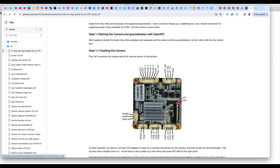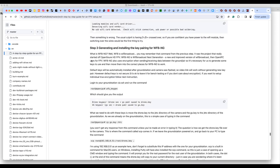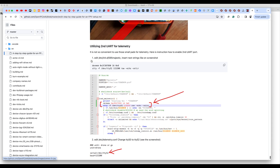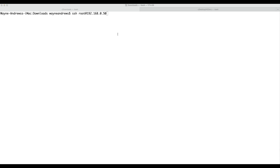If you went ahead and soldered your serial connections on the TX and RX here, you don't need to do this bit. As I mentioned in the last video, I found that a bit dodgy and wanted to use this second UART port here. So if you've gone along and used that one, you'll need to follow these instructions; if you're using the first one, you won't need to do anything at this point. I need to say thanks to Arvet333, because rather than me having to figure this out myself, he went ahead and made some corrections on my document and talked about how to use this second UART for telemetry.